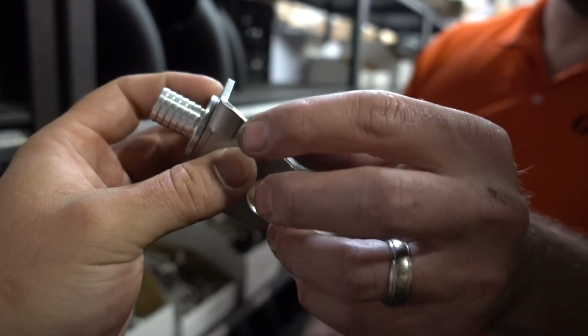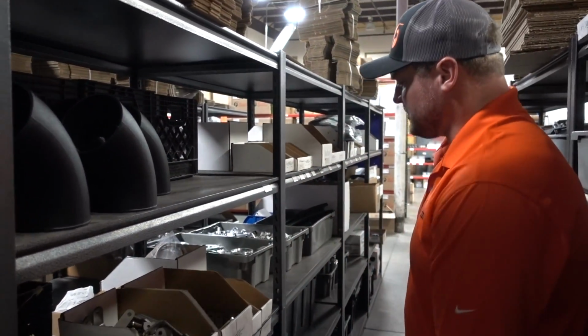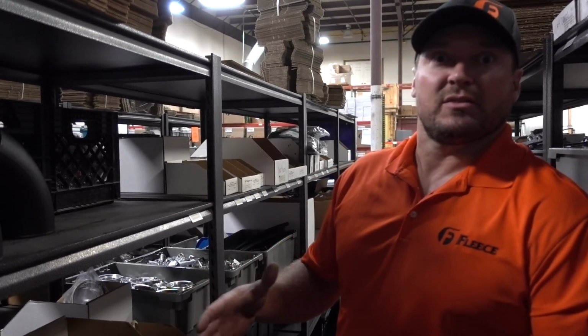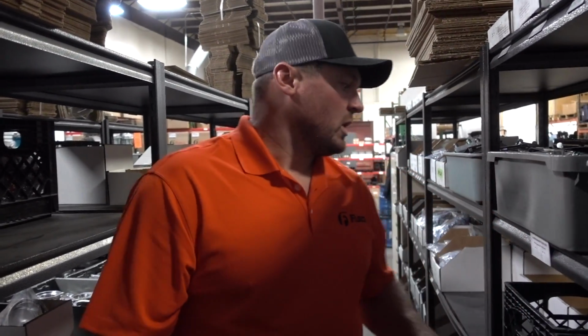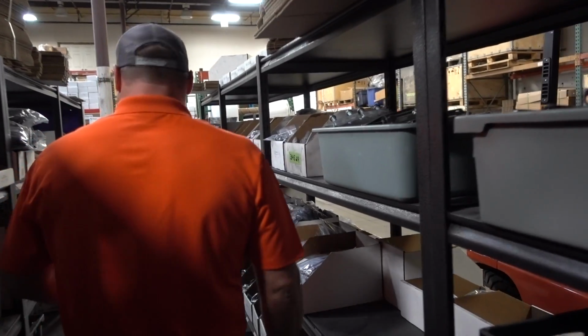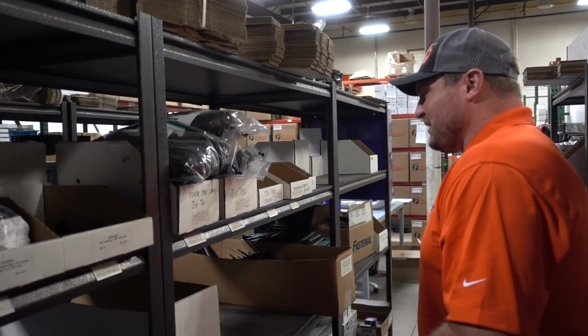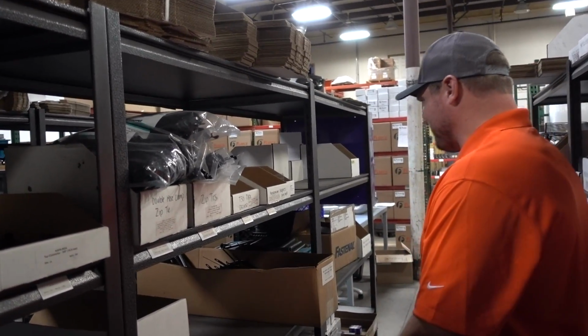Most all of this stuff we design in CAD beforehand, so we'll test fit it on the truck. We have data sharing agreements with GM, Ford, and Dodge, and we have the entire trucks in CAD. So really, when we come up with a new design, we bolt the parts on in CAD. We know it clears the cowl, we know it clears a bracket or the alternator or whatever. I did not know that. Yep. So you don't need a test mule for every generation truck part. Well, that still might happen, but at least you're somewhat prepared. Don't tell them, because we all want to have new trucks.